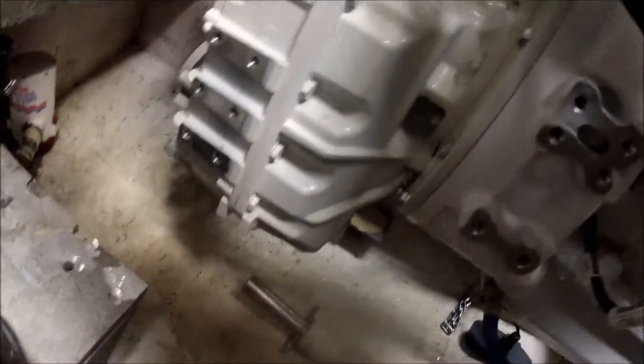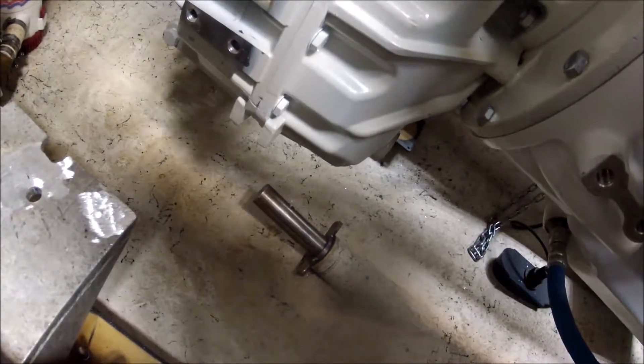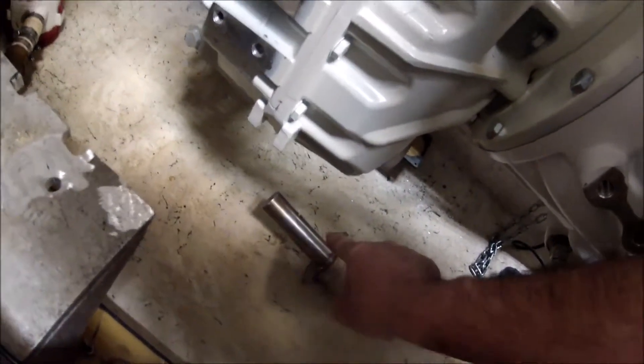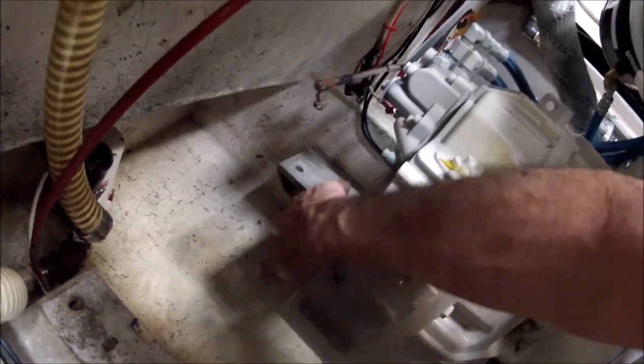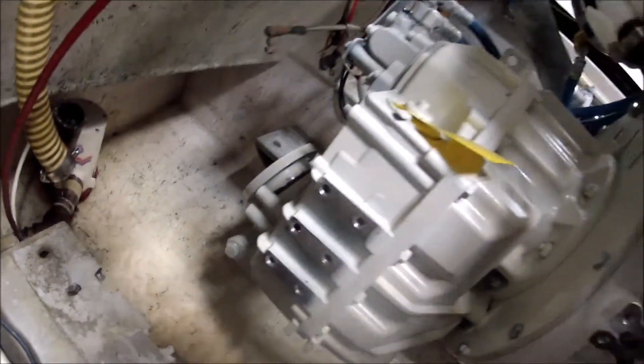Here's the shaft. I made a little bushing that centers the shaft into the shaft log here, so it's lined up with that and the strut in the back. So you basically put the motor in — that's your point that you're aligning to. And then there's a hub that fits on the end of this that has to be flat within a thousandth of an inch to the surface, and we're right there.